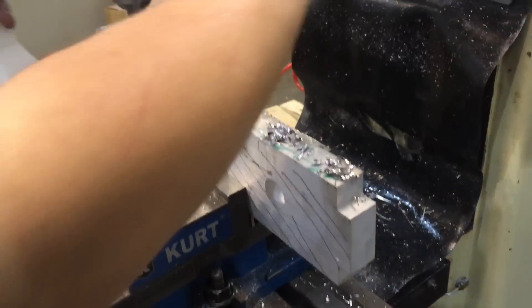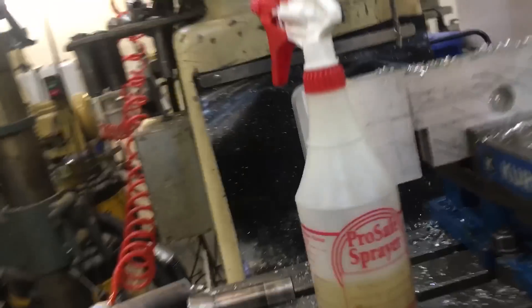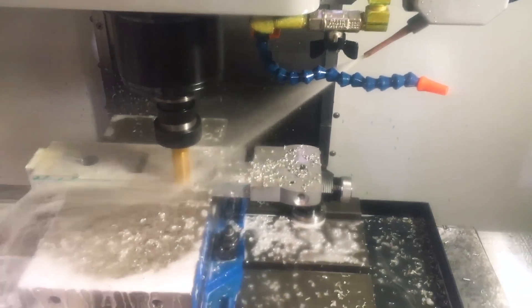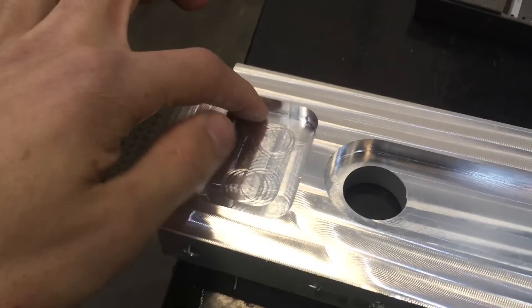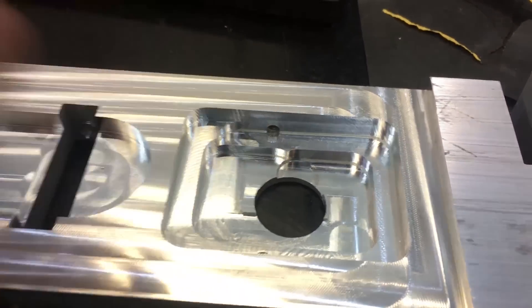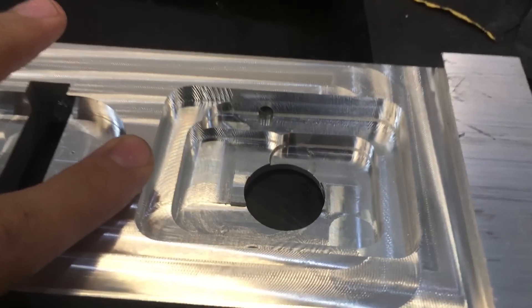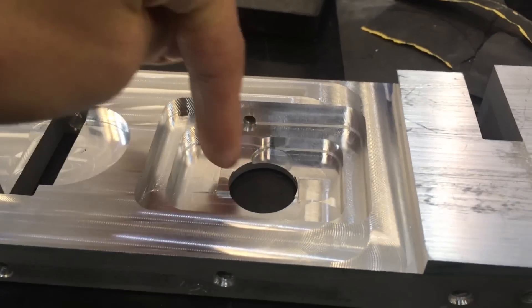Right now I'm making Mandy's side plate. We just completely messed up real bad. These pockets are all quarter inch depth, but then we get to this one which is almost all the way through, and it's bumpy with weird steps. What happened was the part vibrated when it was being cut, and it shook the end mill out of the collet - the end mill just kept dropping as it was going through the cut. First Mandy gearbox is done.